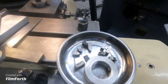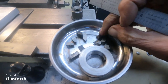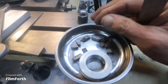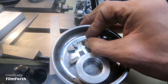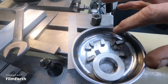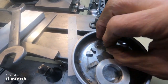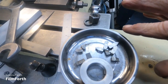I've got some grinding to show. These are automotive line boring bar main bearing cutters - pretty common for that type of work. For line boring bars, real short cutters like this. Looking at them, they're just quarter-inch threading tools that they ground across the top - ten-thousandths - kind of shortened them ten-thousandths. You can see the carbide from this angle and maybe from the top too - they just ground across the steel and the carbide.